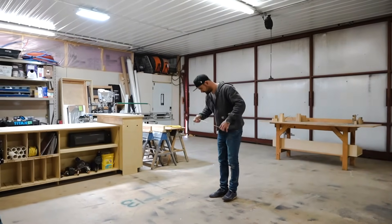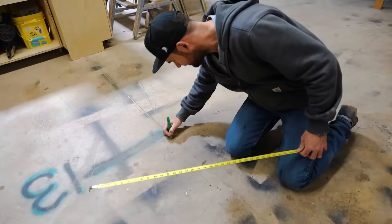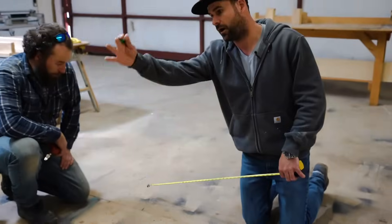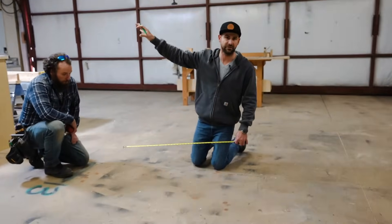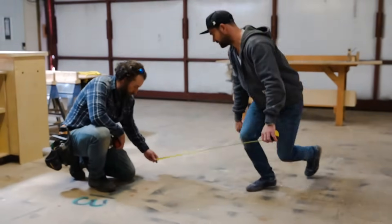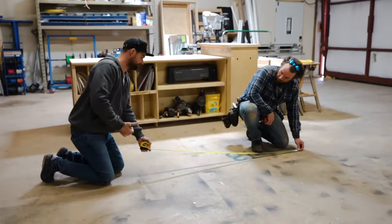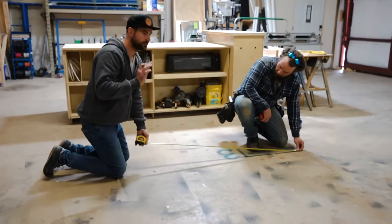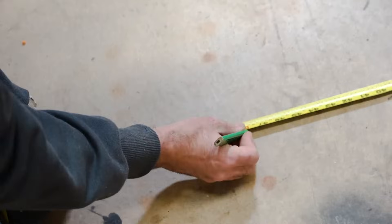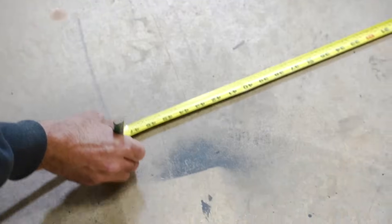Here's what we're going to do. Let's say we have our corner and it starts right here — that's where our corner starts — and then we're going to make a wall that goes out that way. So how do we make sure that wall is going to be straight? We're going to use the same thing we used in there, except we're going to go a little shorter this time. We're going to do three and make a mark, and then we're going to go over here. Now we don't know where the wall is going to end up — we don't know if it's here or here. So you take the pencil, put it right on the four foot mark, hold the pencil with the tape measure just like this, and you're going to create a little arch just like that.